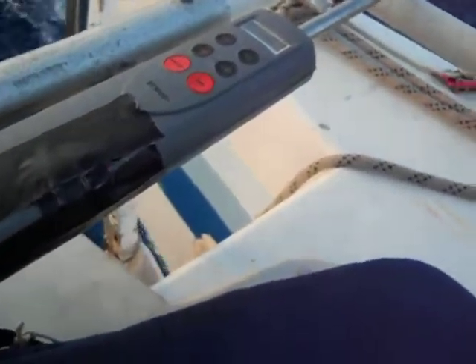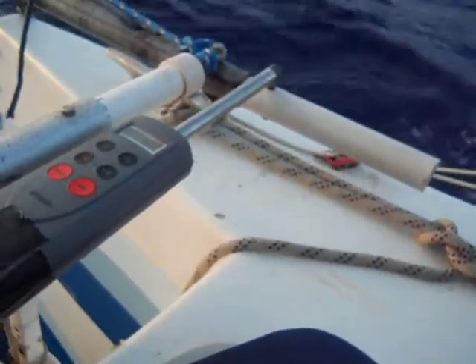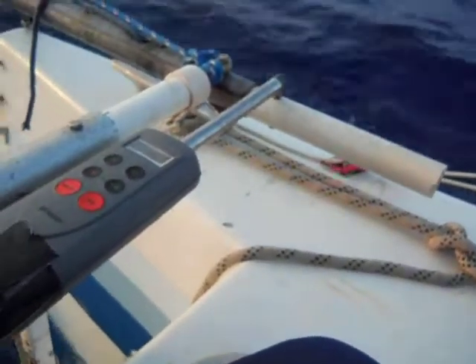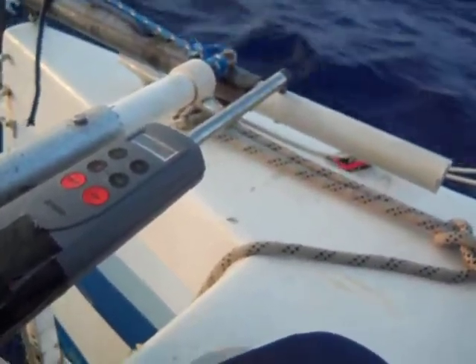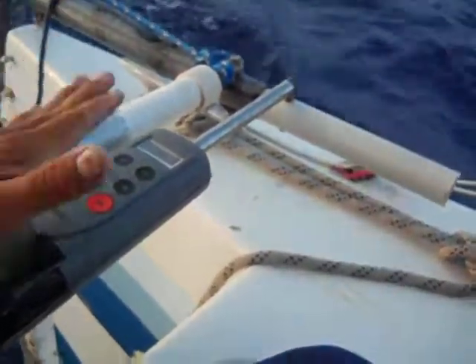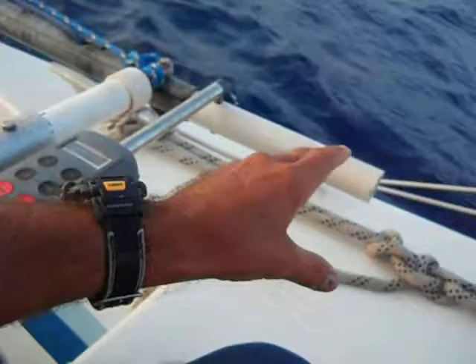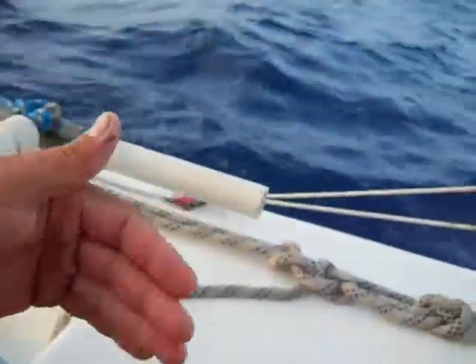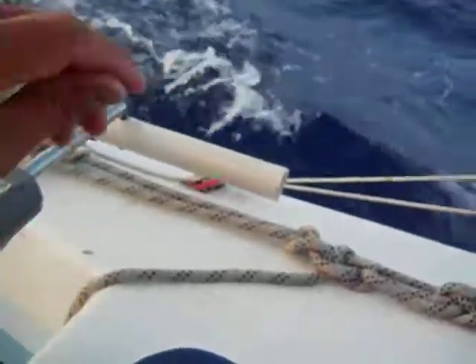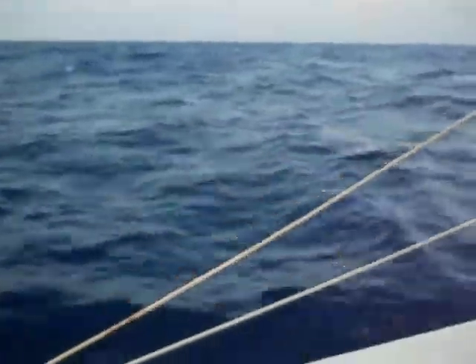I've got the motor running and all that's great. But really, I can simplify this thing a great deal for a backup. Find a sweet spot on your boat, set it. It could be a broomstick, a piece of pipe. But you have to machine it down to where it will find the sweet spot and hold that sweet spot. This is a hell of a lot easier than holding that tiller handle. I can grab that tiller, make an adjustment — six, eight, ten degrees — put it back in place, and boom. Walk away, for a few minutes only. And this is in moderate seas, one to two, three footers. Just gives you more time.